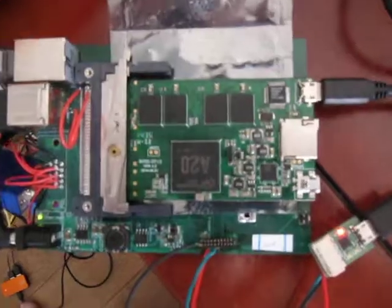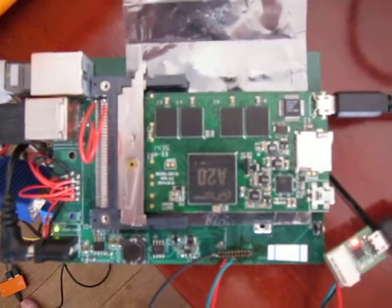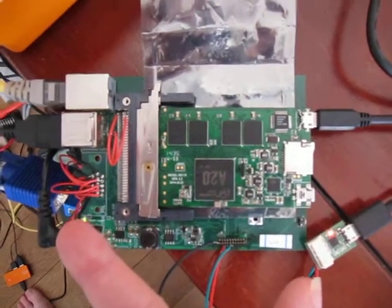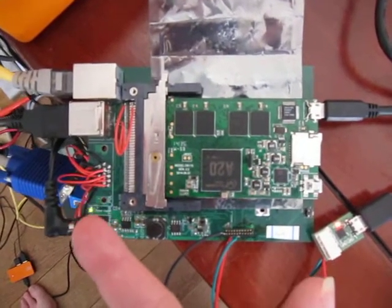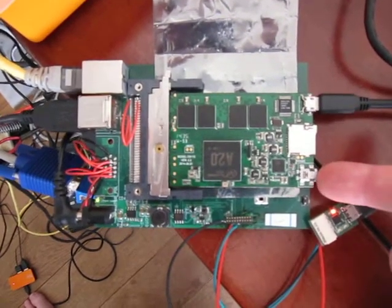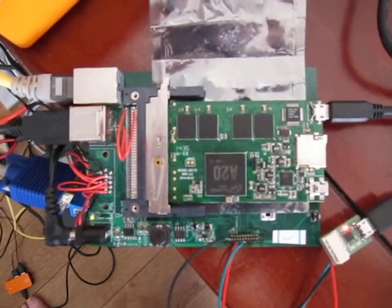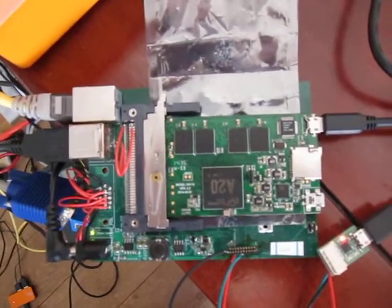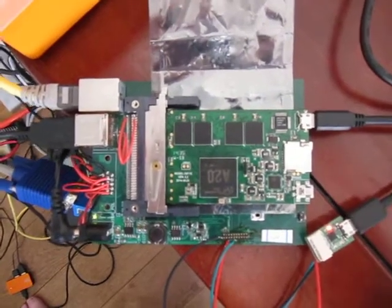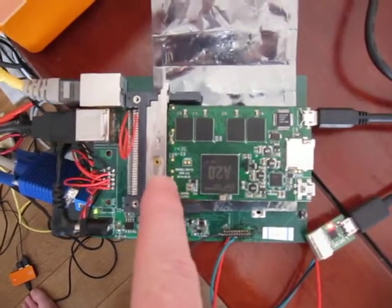So these cards will be basically adaptable to the circumstances of those things they're plugged into. Also present on here is not only the VGA converter, which only goes up to 1280x800 officially in the standard, but there is HDMI output. That one. That's USB on-the-go. HDMI output will go up to 1920x1080 at 60 frames a second, no problem, including audio. Second micro SD card slot on here. You'd use it for whatever you want, but typically it would be for applications and operating systems. There is also 4GB NAND flash underneath here.